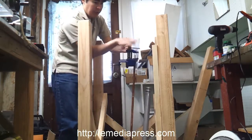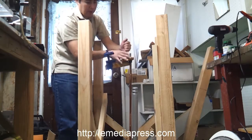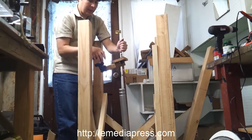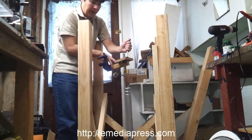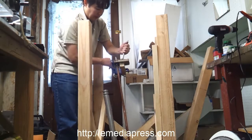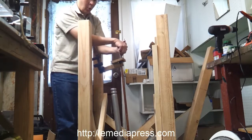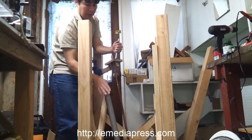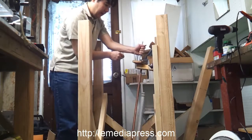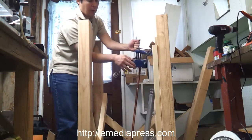motion. So this weight is what's swinging the bracket around, so that the corner of this coupler that this shaft is connected to is going to follow it. Because this is leading it like this, and wherever this is whipping this bracket around, that's what's controlling the angle of this, or its position. So if that upper weight goes right here, it's going to whip this around here, and gravity is what's going to make this fall to the incline. Again, if I want to put that right there, that's going to follow because it's going to the inside of the angle.